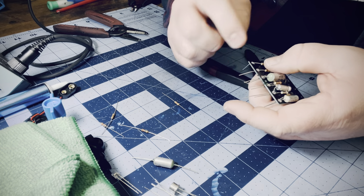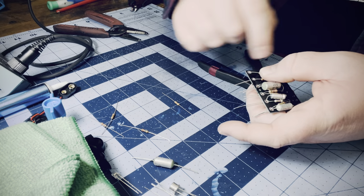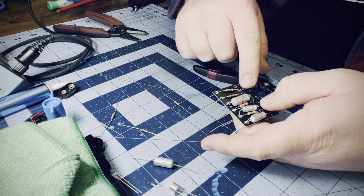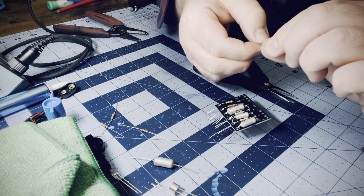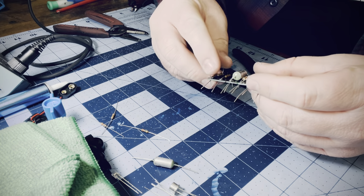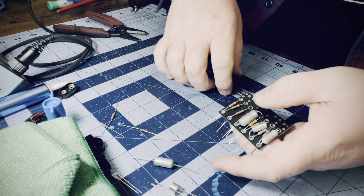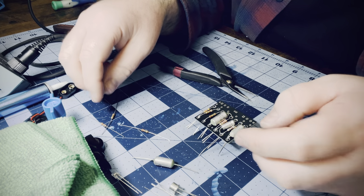On this, it meets up in this top corner and then splits off to a few places — this would be where it goes to the output to the volume pot down here. There is a resistor that goes to ground on the output — in this case it's 47K. That's the stock value, probably the most common as far as the values you would typically see on a Mark One.